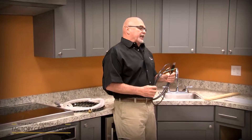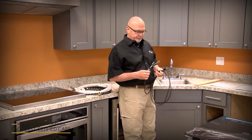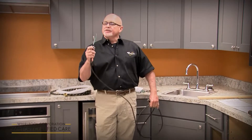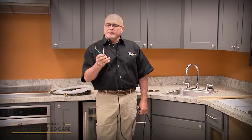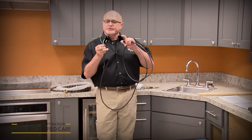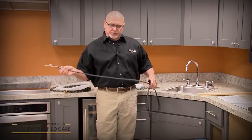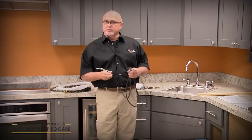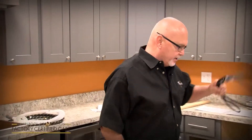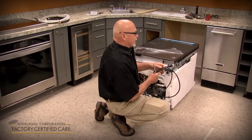You also need a power cord. This model line has two new power cord accessories — we've gone away from the old wire nuts in the terminal box to an actual terminal with screws. The power cord has eyelets on the green, black, and white wires that you put a screw through into the terminal box. There are two part numbers: one with a straight plug and one with a right-angle 90-degree plug.